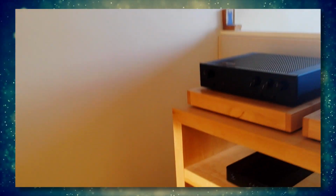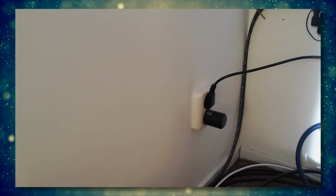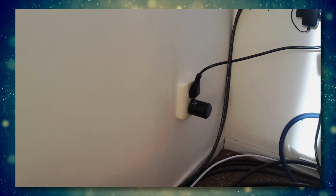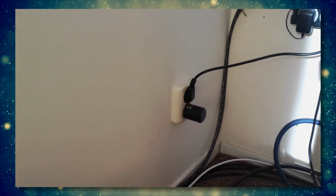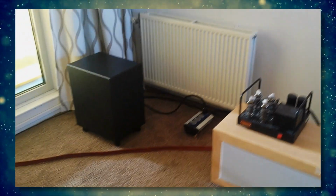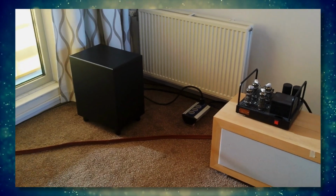One of those things could, for example, be a power receptacle over there. If your next door neighbor has a power receptacle at the same spot, it's like an open tunnel, and that could be a way where sound goes through to the neighbors. So let's talk about structure-borne noise and how to avoid it.